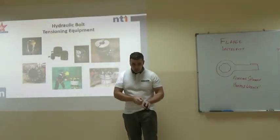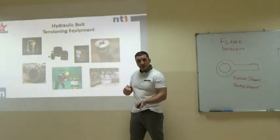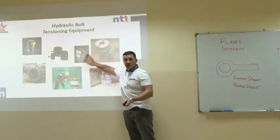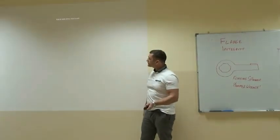Remember I told you what we do is we stretch it like a spring manually. These do it hydraulically. So these pre-stretch the stud, and all we do then is flick the nut down and release it. This way we have no friction to overcome. We use these in subsea applications and places like wind farms and things like that.